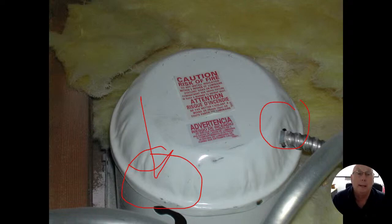If you put a can light like this in between the first floor and the second floor, so we go in the first floor ceiling, and you don't have any insulation between the first and second floor, that's what they're designed for. That's fine. But once we start putting them in attics or ceilings where the attic above it is an unconditioned space, now we're asking for trouble. And this is not a good idea. So white is typically going to be non-IC, silver is typically IC rated, and I think that's all I got for you.